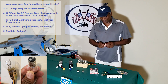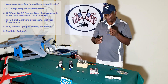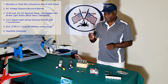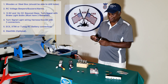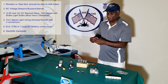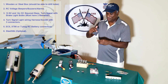So that's the bulb. You also need the socket for it, which you can buy online. Make sure you buy one with three wires, not two wires, because we have three connectors — one for the common (which connects to the frame) and two wires for the two connectors in the bulb. You can see in the close-up on the screen there are two wires connected to these two connectors going to the bulb.